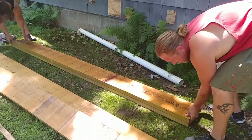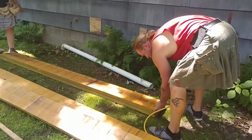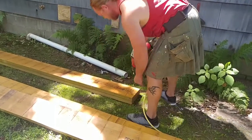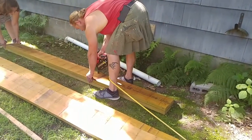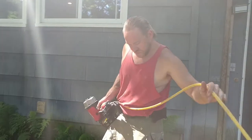Just like that. Now we've got our double micro-lam. We've got three-inch nails in here, so we're just going to angle them a little bit so they don't go through. Just like that — we're going to feel a little bounce, just going to push. Now we're just going to finish off the board just like that. Take a hammer, set those nails in. Then we're going to put it in.